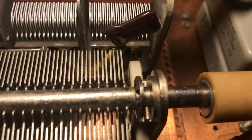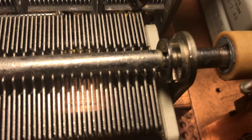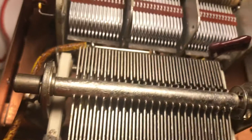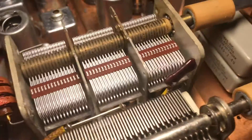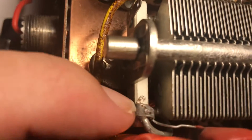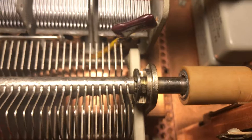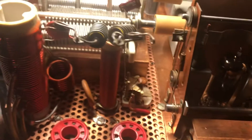Had the knob taken off, trying to get it to fit back on here. There it goes — give it a shove, there it is. And there's the plate. So you've got to check this stuff, make sure it's grounded. This variable capacitor connects through these lines here, hooked up into here. I check this stuff for shorts and the caps are not shorted. I guess I'm going to put the tubes back in and fire it up. See if moving that coil helped — I doubt it, but let's give it a try.